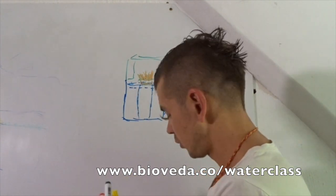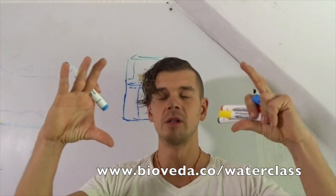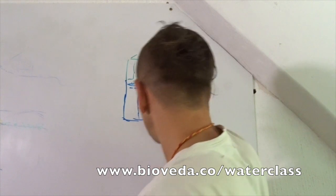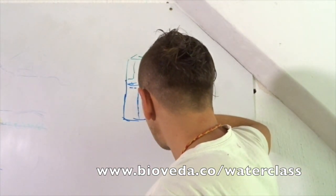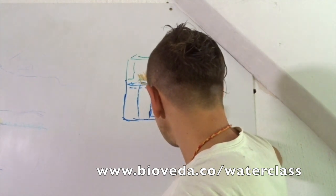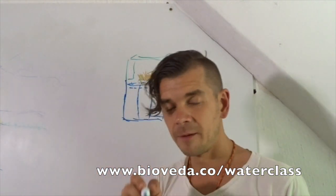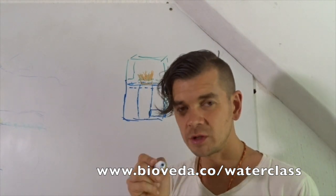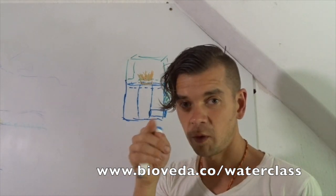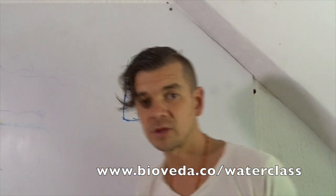But let's talk about the mechanics. So you've got the blue drum. In the blue drum, we're gonna stick in a 25 mil pipe, 25 millimeter diameter pipe, that's gonna drive as close to the bottom as possible, and it's gonna have a slight angle, and it's gonna extrude out. Okay, so you'll just need to play in terms of the distances and measuring tape, and you'll need to cut a hole there, and you need to cut a hole there. You drill a hole in with a drill bit and then use a jigsaw. You go and you cut it out. Measure seven times, cut once.